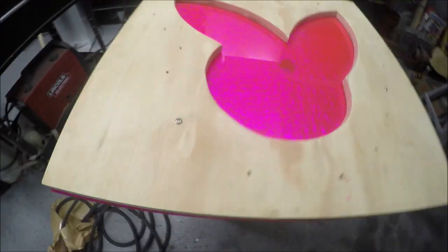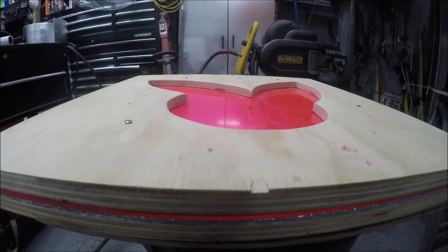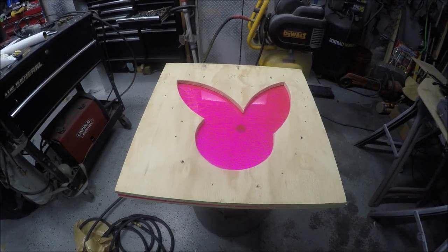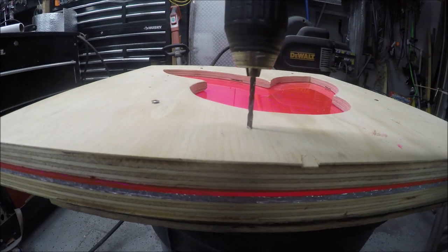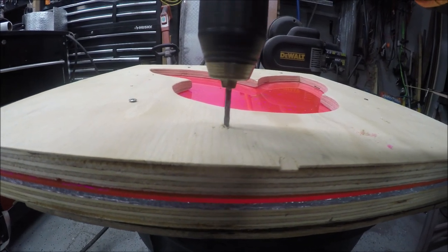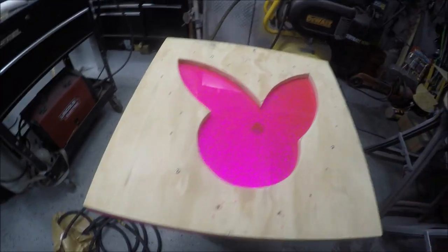Something very, very important that I cannot stress enough: do not put a screw directly through the plexiglass until you pre-drill — otherwise you will crack it. This is only eighth-inch plexiglass, by the way, off Amazon, I think it was like 63 bucks, which was kind of expensive compared to smoke or clear, but I really wanted the pink. When you drill, you only want to go just through the plexiglass — don't go any further, because when you put your screw in you're just going into a dead hole. Do it slow, and once it falls through, you're done. When you hear it pop, pull it out. Rinse and repeat.